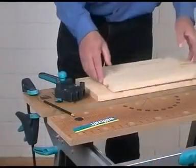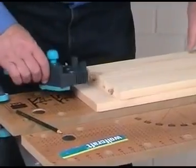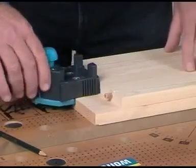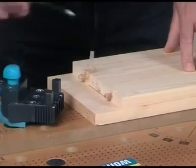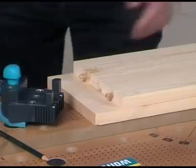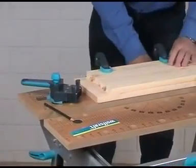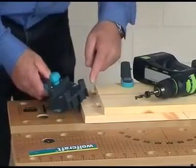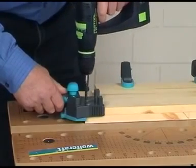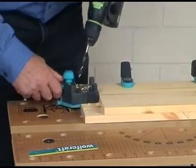Place the top of the shelf flat on the side of the shelf. Afterwards place the Dowel Master on the side of the shelf and move the top until it lies against the stop of the Dowel Master. Mark this place with a pencil and draw the top back a little bit, then clamp both boards with clamps on the workbench. Put the Dowel Master with the 8 mm guide groove over the dowel until the stop hits against the lower edge of the board and drill the two drill holes — but pay attention that the drilling depth must be only 14 mm this time.